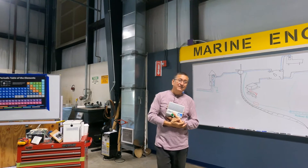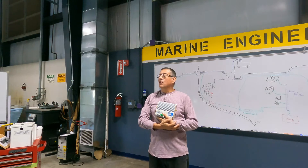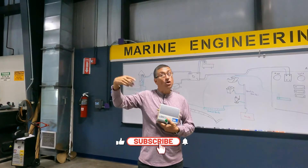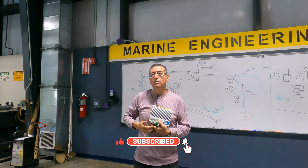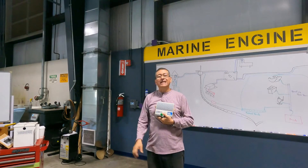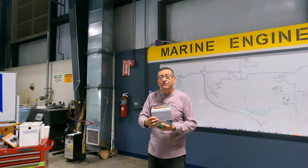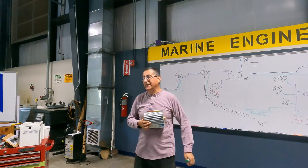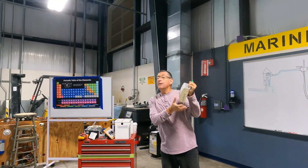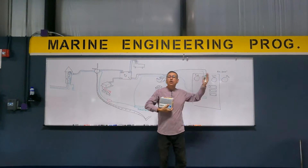You like it? Is it clear? What is the only equipment needed to block bad currents coming from the building into my boat? The galvanic isolator — that's it. If you don't have one, your boat is not protected. The capacity of this unit is 30 amps, because the capacity of the main breaker in the AC panel is 30 amps — it's sized accordingly.